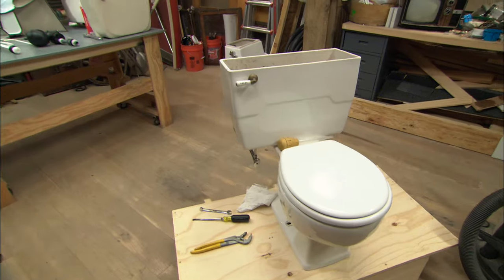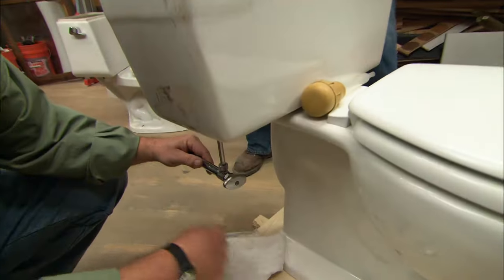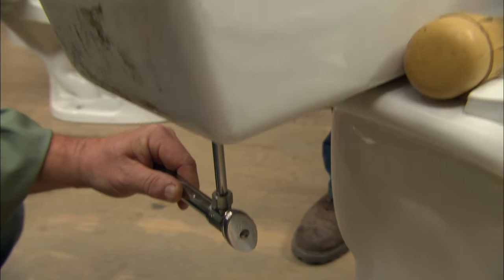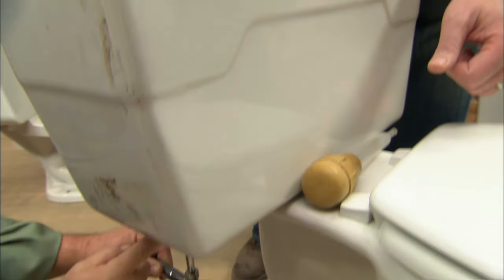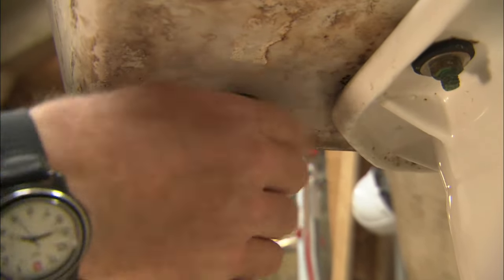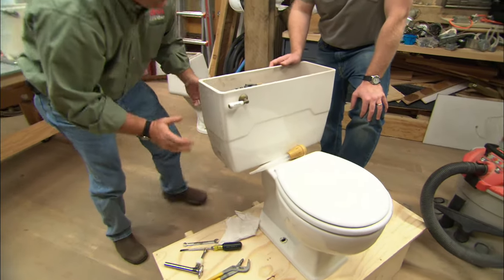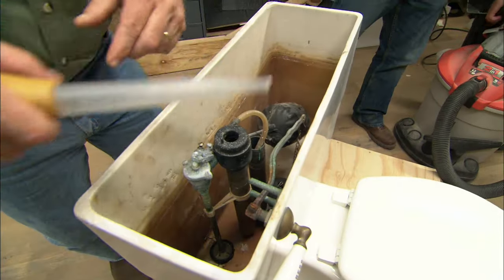If you've got a real leak that happens all year round — dripping down onto the floor from the tank — you need to rebuild it and take the tank right off the bowl. Before we take the tank off, we need to get the water out. That starts by turning the water off at the shutoff valve where the pipe comes out of the wall. Once that's off, flush the toilet so the water leaves the tank, then break the water supply connection — you may need a pair of pliers, and put a rag underneath for drips. Use a turkey baster or wet vac to remove the remaining water at the bottom of the tank.